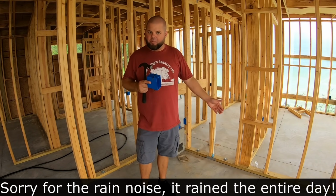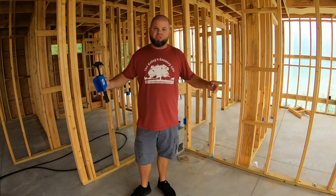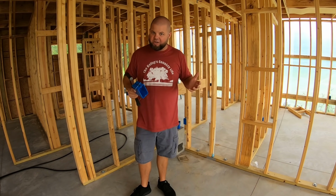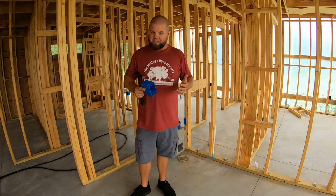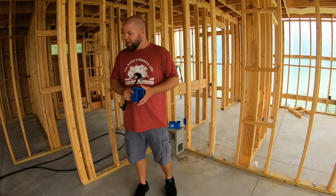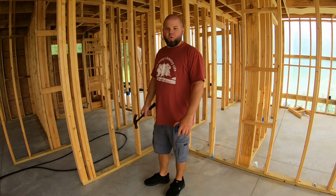So say if you were to put a lamp or something halfway in between 2 outlets, they want you within 6 foot of either side of another outlet to be able to plug in, because apparently 6 foot is a standard cord length. Seems crazy that I have to build to manufacturer's lamp cord lengths, but that's the code.